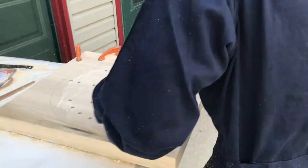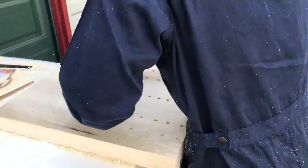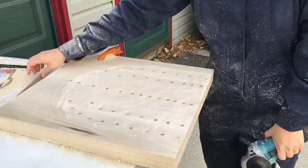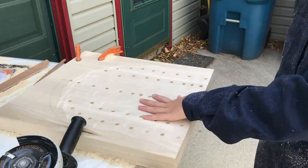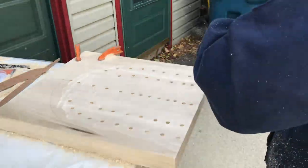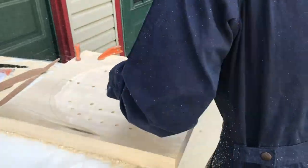The Arbortech Turboplane works very similarly to a handheld power planer. There are three shallow carbide teeth protruding about a 16th of an inch. If you take a cut deeper than the blades, you bottom out on the body of the turboplane. This works as an excellent safety feature, limiting your depth of cut to a manageable amount of wood at a time. You are much less likely to lose control over the angle grinder if the blade unexpectedly grabs at the wood.